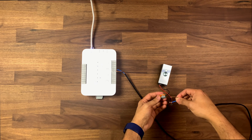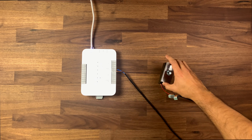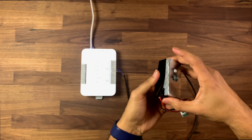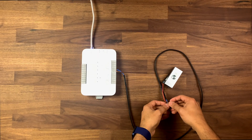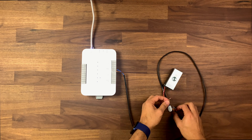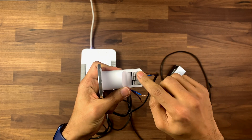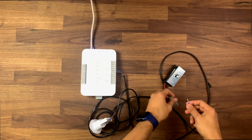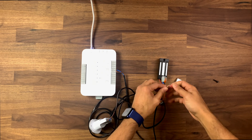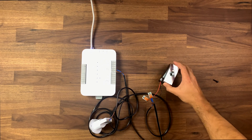We plug the common into the black and the normally closed into the red, and now you can see it's magnetic. If I take those out, you can see the door comes off quite easily — it doesn't hold. But as soon as I pop the rescue key switch on here, we plug the brown into normally open and the blue into the common. We join the blue into the blue, and for the brown, spin them together — and there we go, that's now connected back up again.